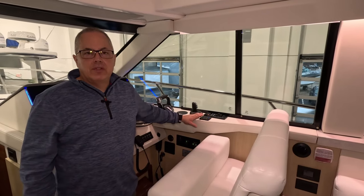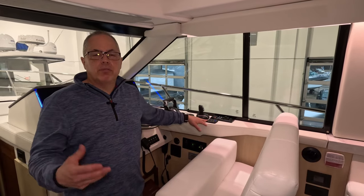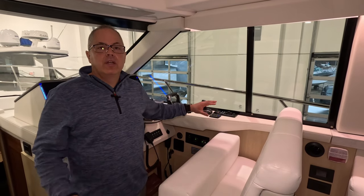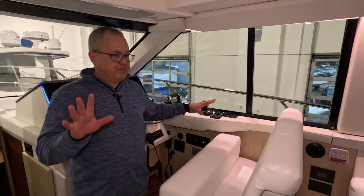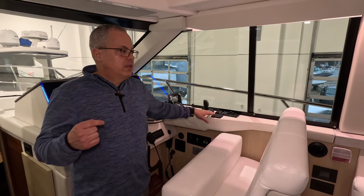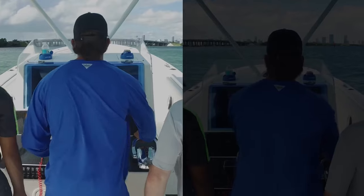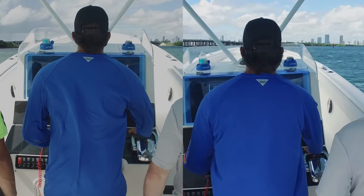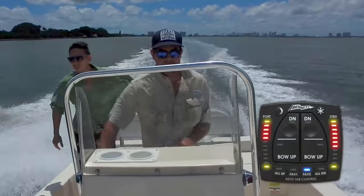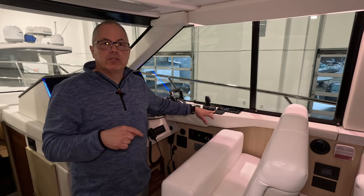The next system installed is the Bennett Auto Trim System. There are different automatic trim systems out there — some made by Seakeeper and other manufacturers. We went with the Bennett system because we already had Bennett Trim Tabs on board. It was really just buying a black box with a new controller that uses the existing Bennett Trim Tabs for automatic function. I think Regal should be offering this as an option — they do offer it on the 42, so why not the 38. It automatically pushes the trim tabs down as you accelerate so you don't get that big bow rise, and you don't have to manually adjust trim as you push the power up. It's via an accelerometer, and I look forward to seeing how it affects performance.